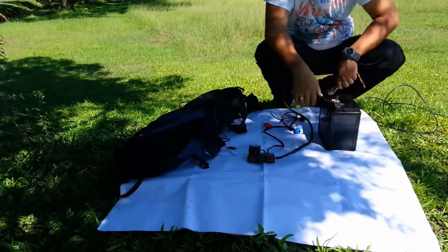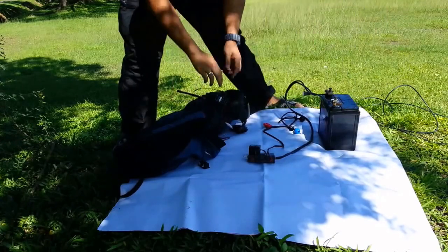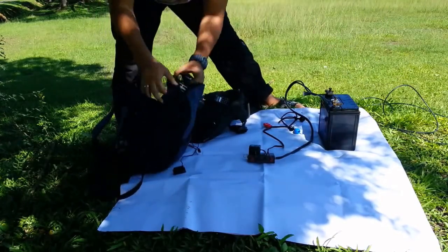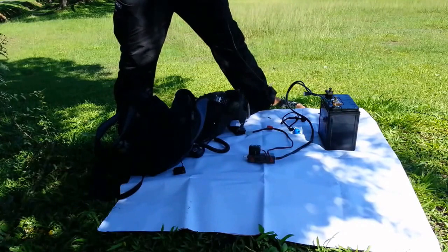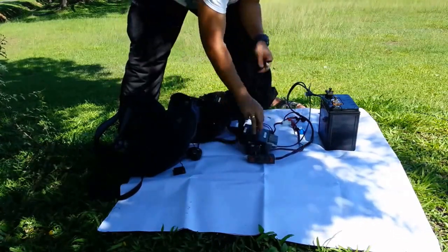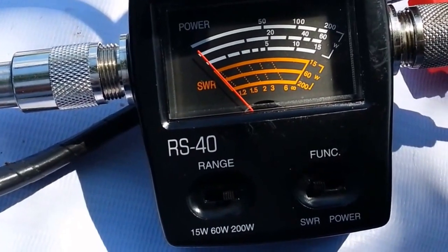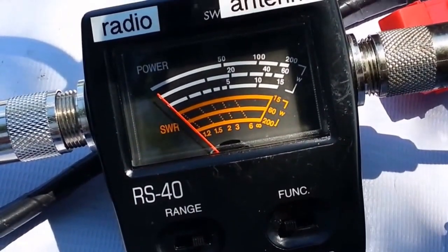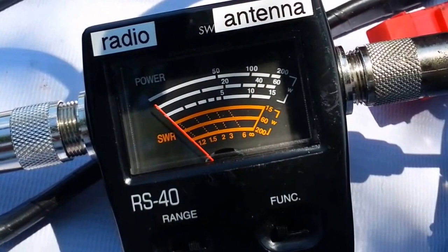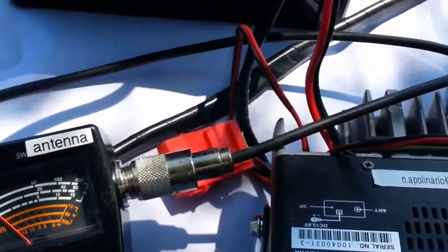When tightening the bolts, make sure your pliers or wrench won't short out the two terminals. That's my mobile radio — it's an ICOM IC-2300H, which can put out a maximum of 65 watts — and I'm attaching a blower I mounted under the radio. I'll check the SWR at 25 watts to see if it's safe to transmit. Three, two, one — DW1 Yankee Golf Quebec, good morning. Wow, that's good SWR considering it's an ugly antenna!